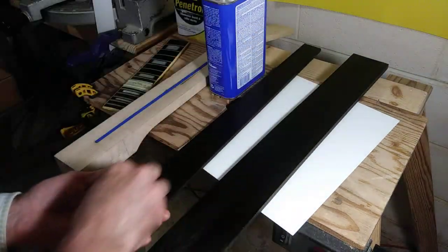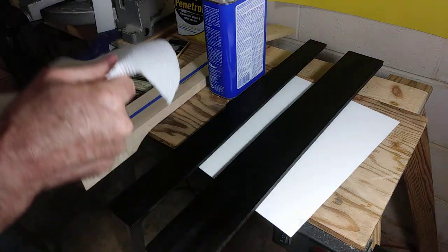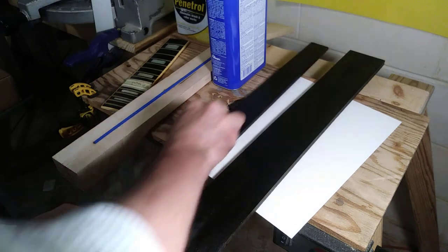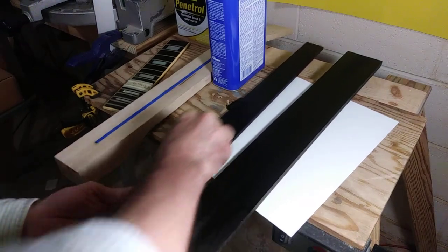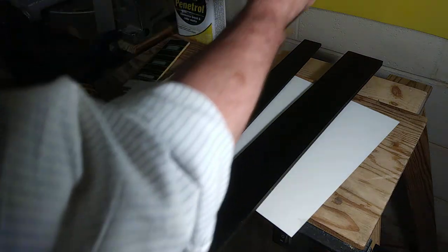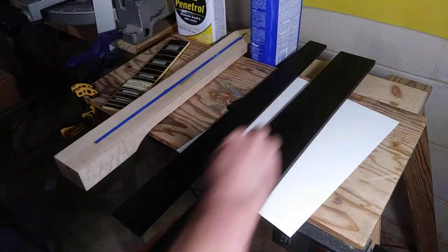With acetone it'll be beautiful and dark for just a brief moment, then it'll get really bland again because it'll be dry wood. Penetrol is probably a mix of boiled linseed oil — which will dry — and raw linseed oil, which they claim will not dry. A lot of boat builders used raw linseed oil in the hull of Carvel-planked boats, where the wood would stay very wet and oily.